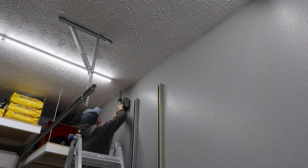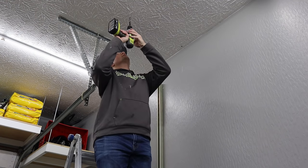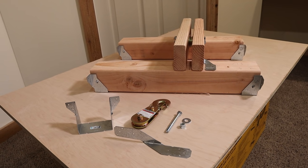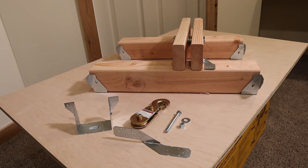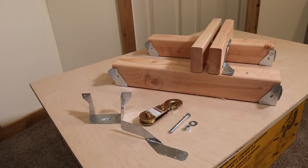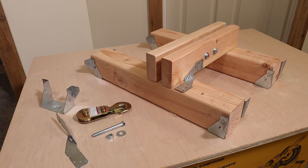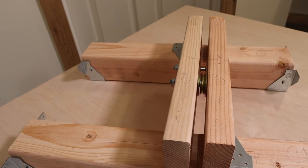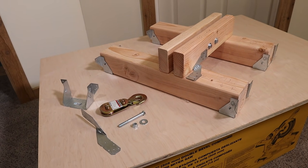The next step was to drill out all the holes in the ceiling. I did this first so that I had identification marks up in the attic so I knew exactly where those pulleys had to go to line up with the platform. Here's what I ended up installing in the attic above those holes: they are held up by 4x4s, those 4x4s connect into the rafters using 4x4 joist hangers, and then on top of that I have two 2x4s spanning that distance. In between those two 2x4s is a pulley — I modified this pulley from one that I bought at Harbor Freight. I took off the hook and took out their bolts, replaced them with longer three eighths inch bolts, washers, and stop nuts so that they don't back out. I also have metal L brackets — I think they are called hurricane straps — that I used to anchor those 2x4s down to the 4x4s. There you can see the pulley down in there, how it comes up vertically, and the cable is going to come out one side of the 2x4.